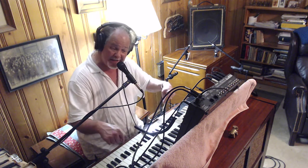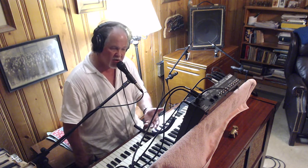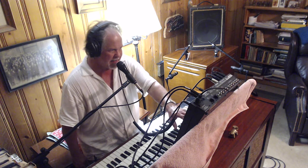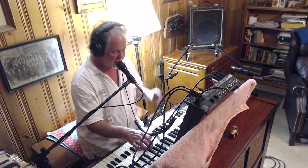This is the A100, not the 105. And the 105 that I did the last video on in the garage is a good organ. It's a red cap. It's got red Mylar caps and probably is in better, newer shape than this one. This is a 1962. But of course, now I recapped the tone generator on this organ, not the 105. So that would be the difference of what you're hearing: a recapped tone generator, the same Leslie I use for the other one, but now I've got a direct line out that I can mix in with the organ signal. That's what has all come together, which is really cool. So here is the A100, and the preamp, the main amp and the Leslie amp have all been recapped, electrolytics. And of course, you know what that sounds like from the A105.